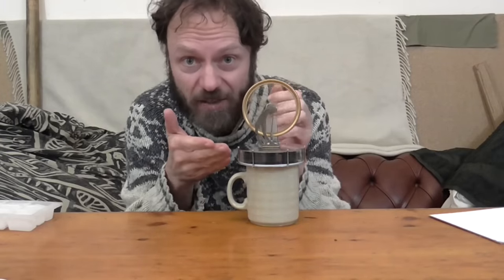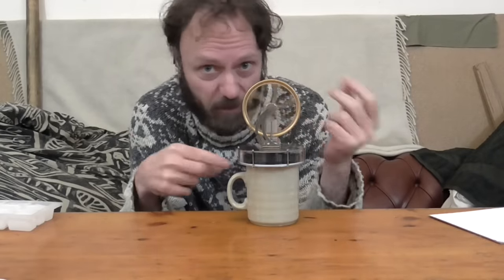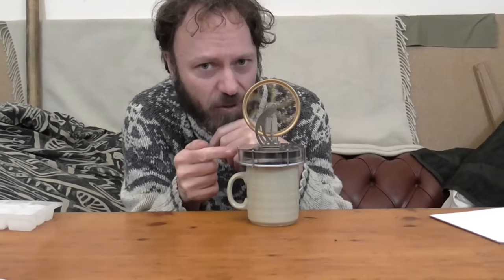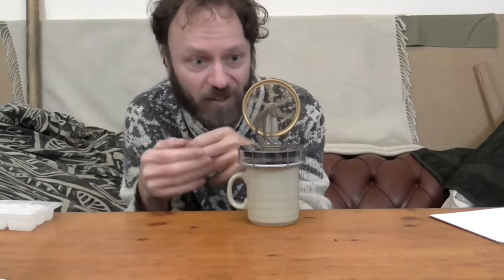So a quiet Stirling engine that isn't going vroom because of the explosions in an internal combustion engine, or psht-kuff because of all that steam and so forth from a steam engine, a Stirling engine can be rather efficient. You've got the heat from the inside of the submarine. And of course, as the submarine moves through the cold waters of the Baltic, you've got cooling on the outside of the submarine all the time as the cold water goes past, which means that you can create, again, a wonderful temperature difference, and you get loads of sort of free energy. It's not free in the sense of breaking laws of thermodynamics, but it's using a temperature difference that exists anyway in practical senses.